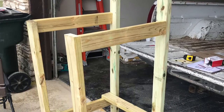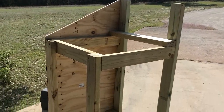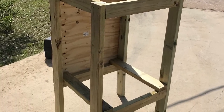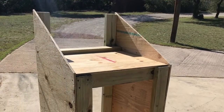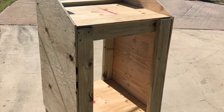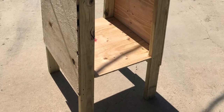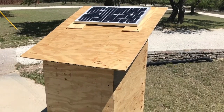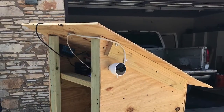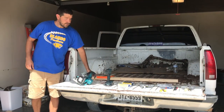Here's the 2x4 construction overview: the left side is four feet high and the right side is five feet high. I cut the plywood — the diagonal piece is a little tricky but you fix it to the side and now you've got a frame. The other side has two shelves; the horizontal pieces required a small cross-shaped cutout at the bottom to fit into the plywood. Then you add the roof and solar panel, run your wiring, and finally put on the door.